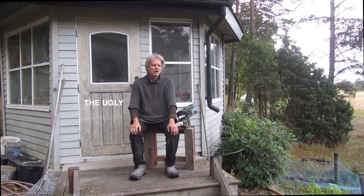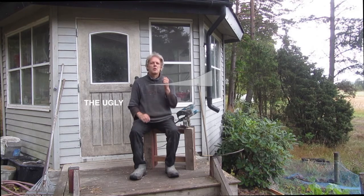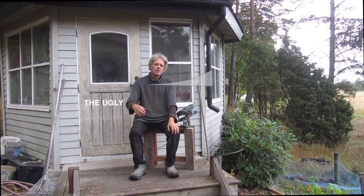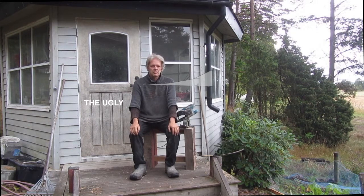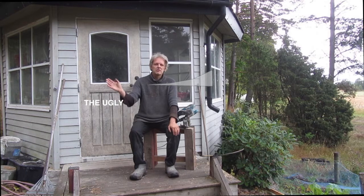Then we have another example from the Southern type of scythe blades that are traditionally peened with a cold hammering technique. They are hammered so thin that you should actually be able to push with your thumbnail on the edge and see how it bends. Well, if you can bend it that easily, it's certainly a very fragile and not fitting edge for a scythe blade used in the fields among branches, stones, ant nests and so on. We can do it much better. The reason for damages on scythe blades is usually caused by this kind of ugly edge. We get rid of that ugly edge too.